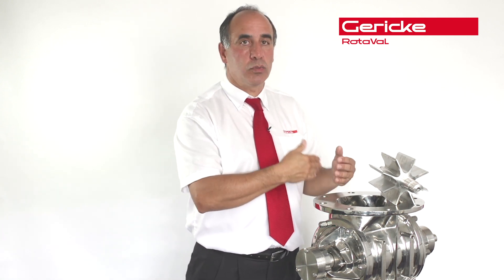Metal to metal is fairly simple. It can either be a trap of product that actually gets caught between the vane and the housing because of the tight clearance — that can be something like straw, swarf, or angel hairs from plastic conveying, which is diagnosable quite easily. It gets trapped and causes the rotor to push against the body and the end cover, which causes the squealing to actually occur.